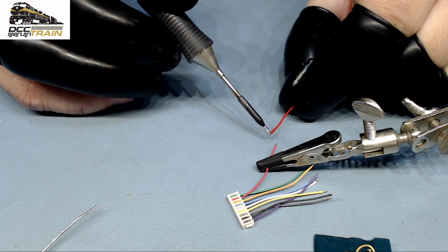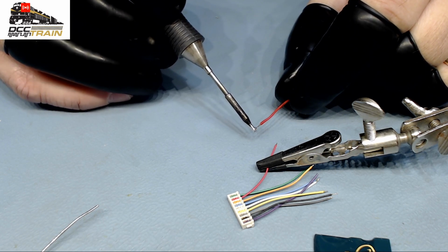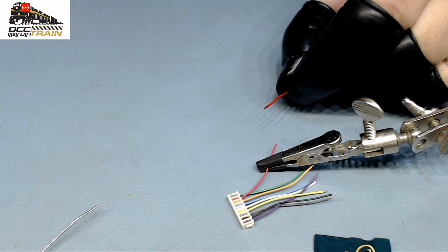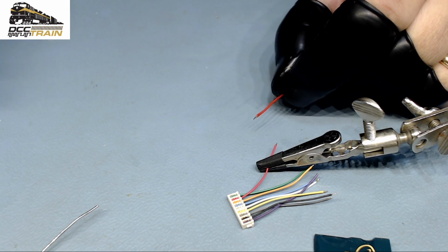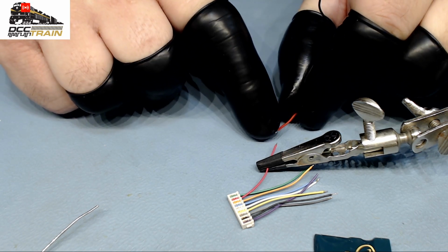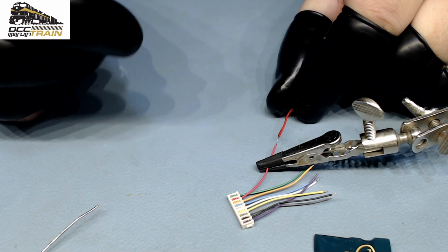This starts moving out the insulation, and I kind of see the end is okay. Temperature 525. I can go probably, yeah, 525 is fine. Yeah, it's okay. For that type of wire it's good. So then I'm taking extra like this. Also, when I'm cutting it, somehow I'm feeling how it's good or not.